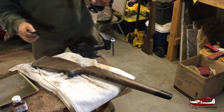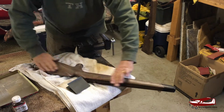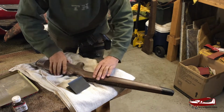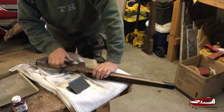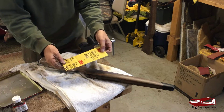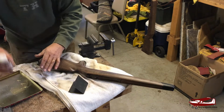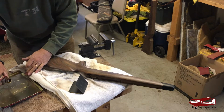So half an hour later, I've just steel wooled that back to smooth again, but the grain is not full, and you can still feel that there's a little bit of edginess to it, you can hear it. So what I'm going to do is this, maybe excessive, but you can't get too fine, 800 grit. I want to make some really fine sawdust with that and this, with the grain filler.